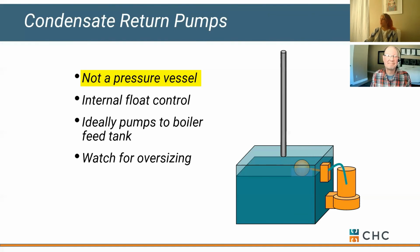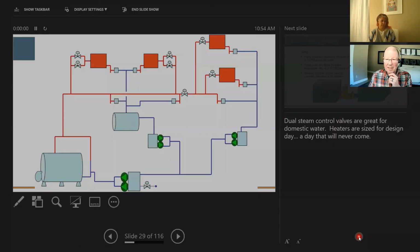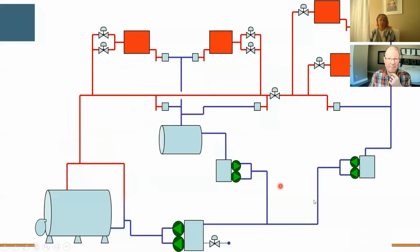What are the advantages of using a steam system versus any other system? That's loaded. You don't need a lot of pumps other than your typical condensate return units or boiler feed if needed. It can be a bit of a simpler system. I don't want to say it takes care of itself, but your main concern would obviously be the boiler. Depending on the layout of your system, you may or may not need multiple condensate return units. If you can get it all back to a boiler feed without having to pump it, it becomes a pretty simple system. In that aspect, that's an advantage.